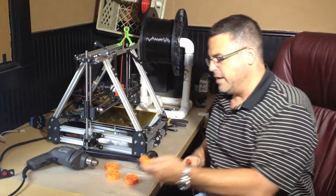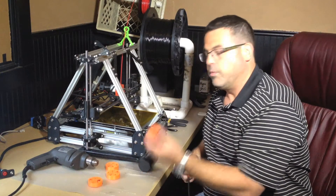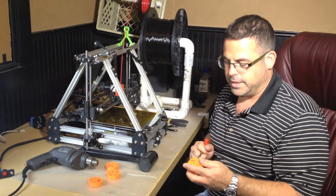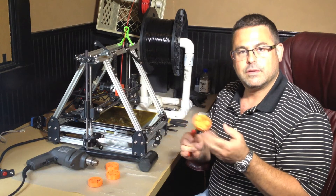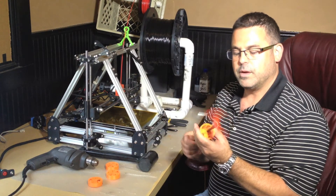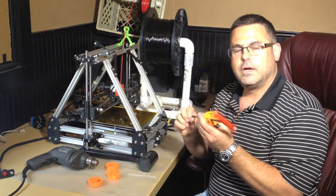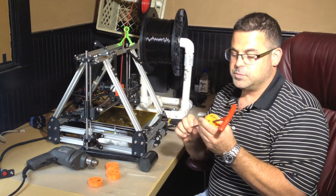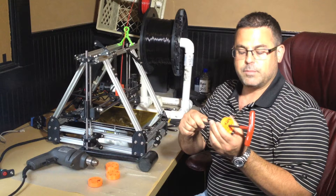After the 0.15, I tried a 0.3. I did the same trick with the hammer, put the Allen key in, and nice — it spins really well. Hopefully you can see that. I'll do it closer up and I'll put it on the electric drill to give it a workout. It spins really nice and there's not very much play in there.